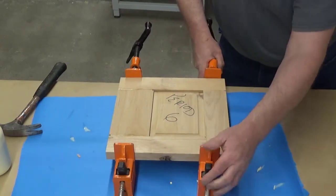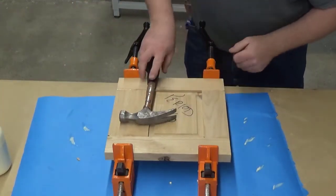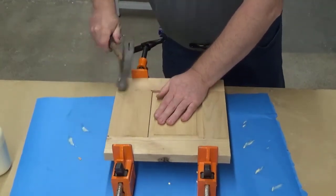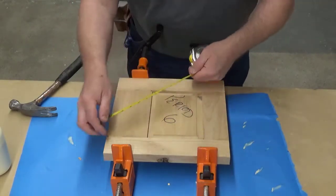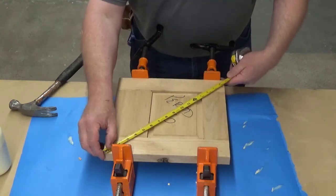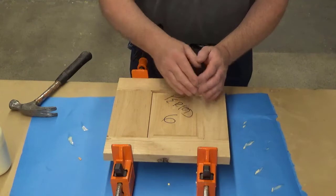I'm going to take the clamps and angle both of them in that same long direction, and when I do that it's going to pull it square. I loosen them one at a time, angle them — and depending on how much off they are, that determines how much you angle them. Snug, tap, and tight — always remember that. Loosen it, angle it snug, tap and tight. If I go back and measure these, it's just a little bit over 7/8 and within reason — they're both a little bit over 7/8. If they were still just a little bit different, I would loosen them one at a time and angle them just a little bit more to make that extra adjustment.